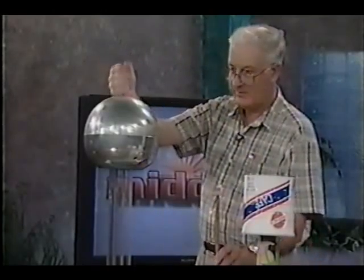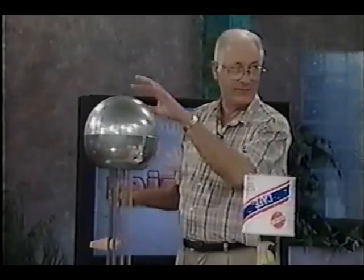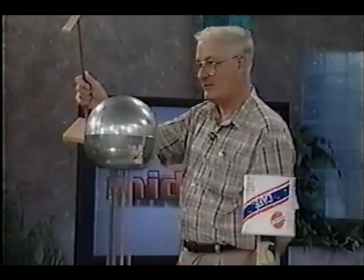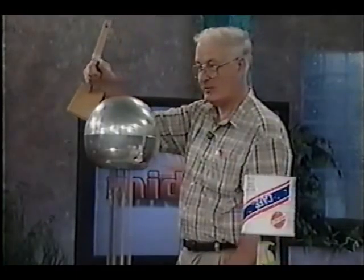So what kind of wattage are we talking about there? The wattage is not very much, but the voltage is very high — you mean the voltage, I guess. It's about half a million volts, which sounds terribly dangerous. It does. But the current is extremely small. Just to show you it's charged so you can see it — this is a little electroscope. You can see it's obviously charged. The dome is charged.